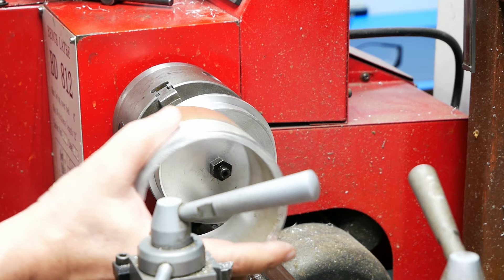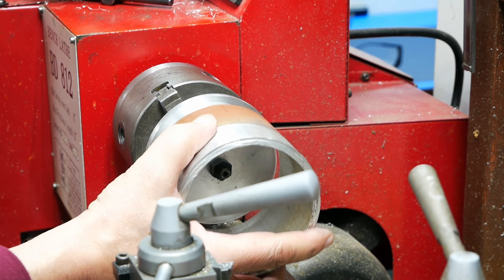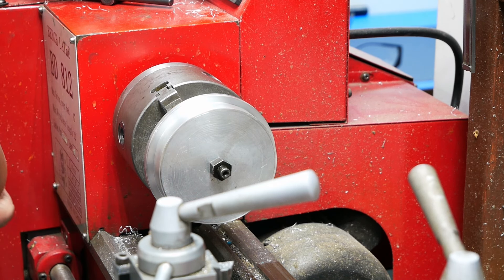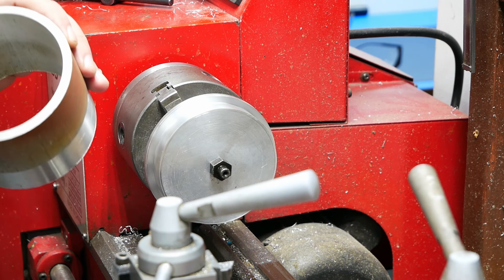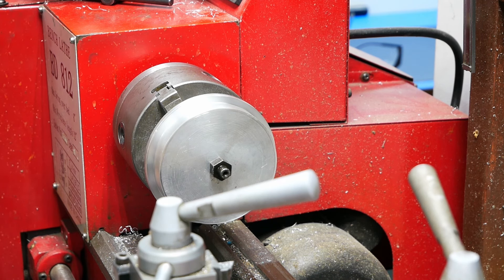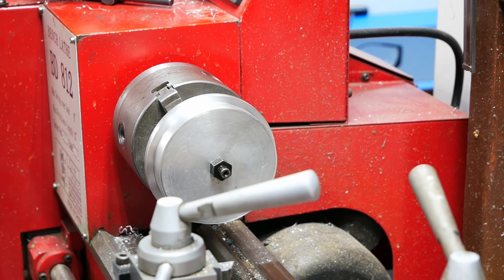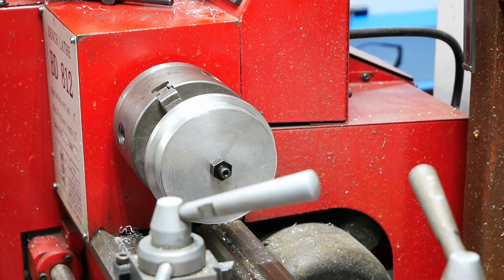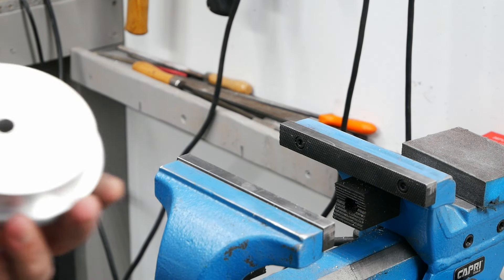This is completely cooled down, and now if I put that tube over it, it really sticks. I'm going to warm this one up a little bit and then press it on there to make sure it never comes out by itself. I'll use the vise to do this, then put it back into the lathe with the outside jaws and make a nice clean run.